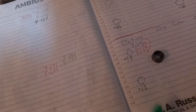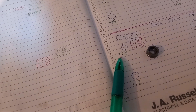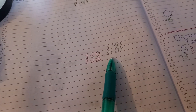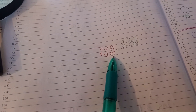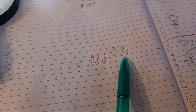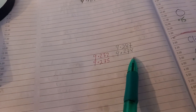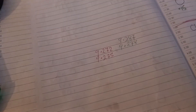This one was 1.3 on the gap. We took two sanding passes to get it down — we were targeting 9.272 to 9.275 and we're at 9.278, so I'd rather leave a little bit on and try that first, but that should be about right.